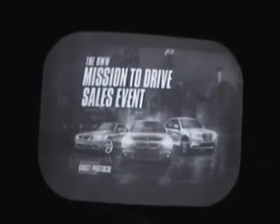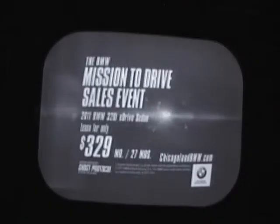I got the filter components and went ahead and installed it. And here's the set playing again with all the tweaks up to date. So got the retrace lines eliminated, got the filter in place, got the ion trap adjusted, the flyback cage cleaned up. I did a quick alignment, but I do want to go back and do it again because I still think I can get a little bit better.